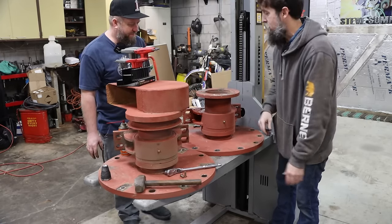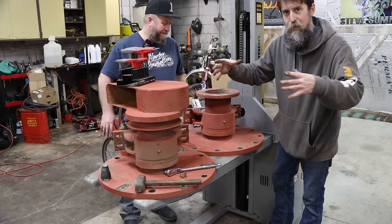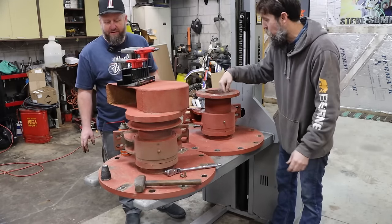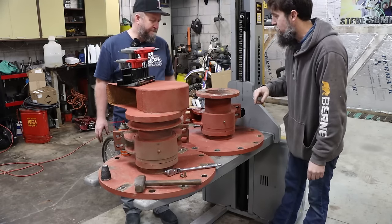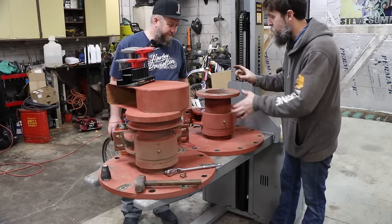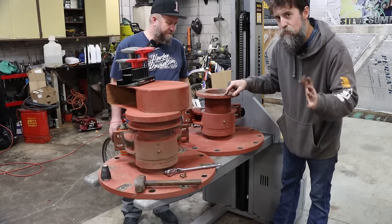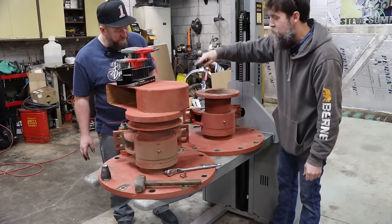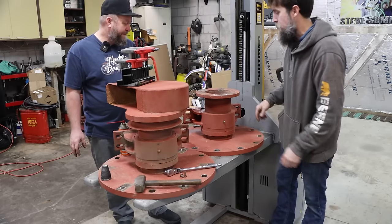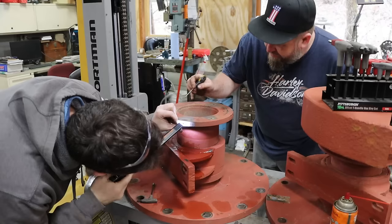If there's not, then I'm going to heat inside of here just to make it swell and contract a bit to break the rusty, crusty bond of these threads. Then I'll probably weld an ear onto this flange is what I'm thinking, and then maybe a hammer, and just try to knock this flange, try to unscrew it with a little bit of force.